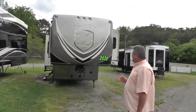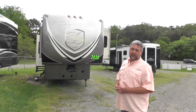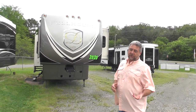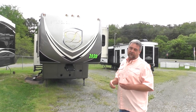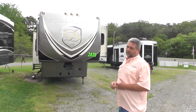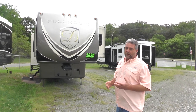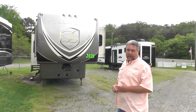With the Full House, you also get a 5,500-watt gas generator and two fuel tanks — two 27-gallon fuel tanks. One is dedicated to the generator and one to the fueling station. But you can use the fueling station to fill the generator tank, so you effectively could have 54 gallons of fuel on board for your generator. The generator will burn upwards of a half a gallon an hour on a heavy load.